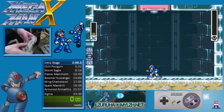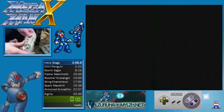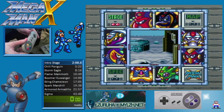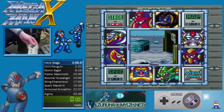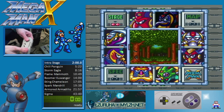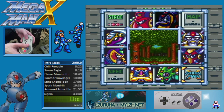I used examples to kind of build the code I worked off of, but in the end I actually had to write all the code myself, because the code I originally used — to basically make the Super Nintendo controller a USB controller — doesn't really work for intercepting the data off the line, because the Super Nintendo is driving the clock instead of the program driving the clock. It sends the clock signal out, then it waits, then it pulls. So pulling from the Super Nintendo in the middle is actually a little bit more difficult, and there's still a lot of optimization I can do playing around with assembly.